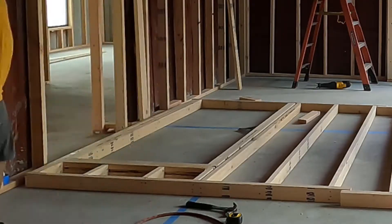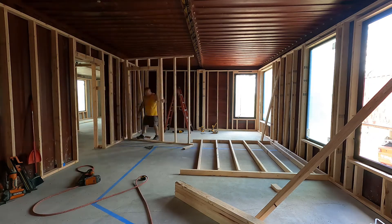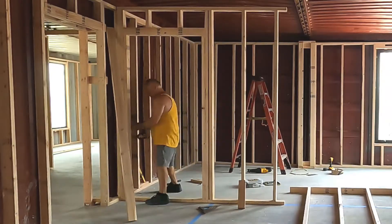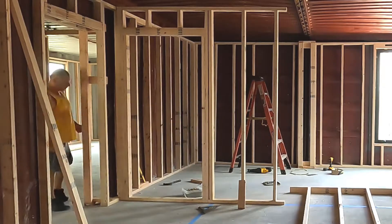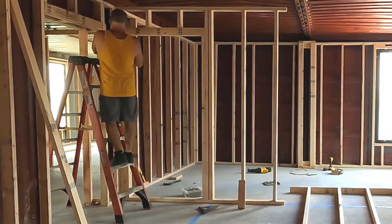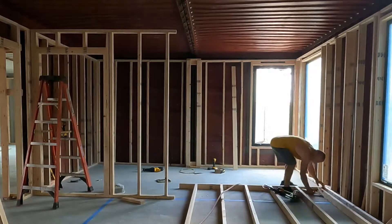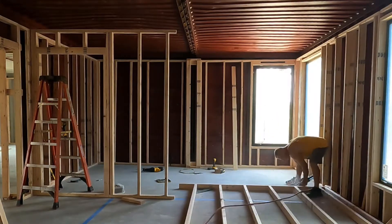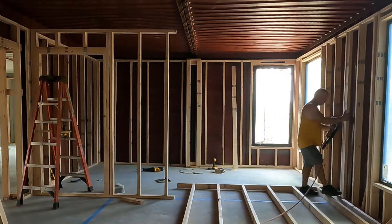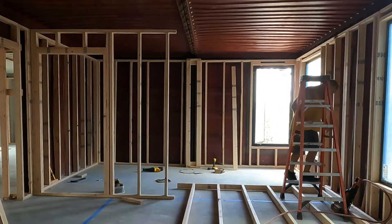All the doors are built the same way — very consistent. I'm actually faster every time because I know the measurements. I do this in halves: nail it up, level everything out, then put back in two-by-fours so everything's mounted properly. I use three-and-a-half-inch screws to put it all together because the nail gun doesn't get into all these crevices. Then I work on the second part of that wall — just a few studs plus extra mounts on the outside wall for nailing, including for the sheetrock.